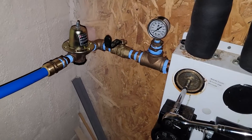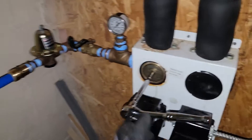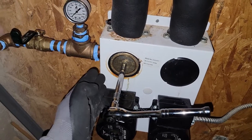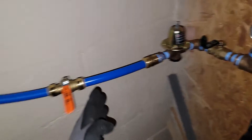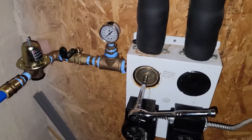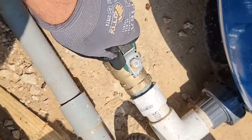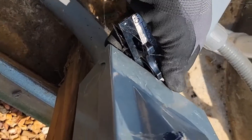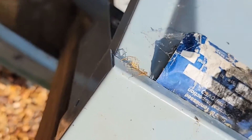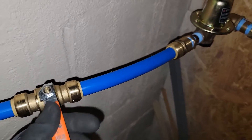Now the first thing that needs to happen is we need to turn the water back on and make sure that our line has no leaks. If it has no leaks, we're going to open this valve up here and change the position so that we can allow the water from that well — which feeds the cold water line — to provide water to our loop. I need to turn the water supply back on. Plug the power back in for the well pump. Water's back on — does it have any leaks? It doesn't look like it.